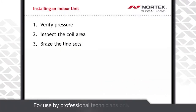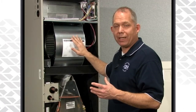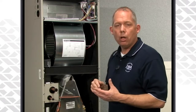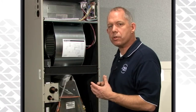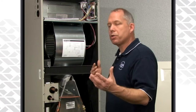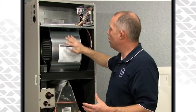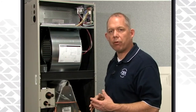As we're picking up and starting to clean up while evacuating the system, we want to double check and verify that our air handler blower speed is set to the proper speed. All air handlers are PSC motors — both heat and cool taps are on the same double spade terminal on the motor. Check with your install instructions; most of the time cool speed is on a higher speed than heating speed. Check based on the amount of KW you have for electric backup heat to determine what speed you should have that blower motor set to. In most cases our cooling speed is set to high speed.